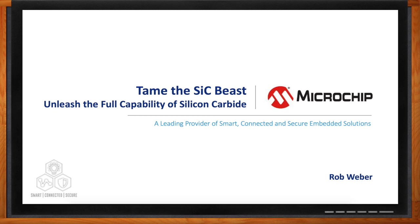Certainly. Silicon carbide is a relatively new material. It's part of a family of materials referred to as wide bandgap materials — silicon carbide and GaN being the two primary materials in that category. The properties of wide bandgap enable devices for power switching to operate at much higher switching frequencies, at much higher temperatures, and at much higher voltages. They're both in the process of replacing standard silicon IGBTs — insulated gate bipolar transistors — as the current technology. The benefit ultimately is higher efficiency and higher reliability in power electronics, which power our cars, enable renewable energy from sun and wind, and other advanced opportunities in both power generation and energy use.